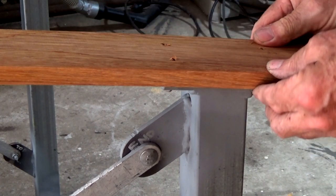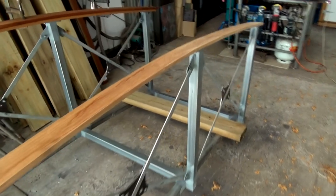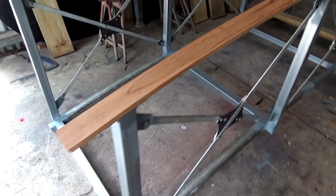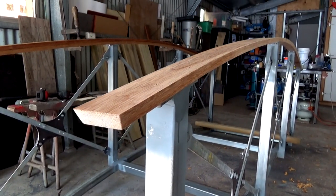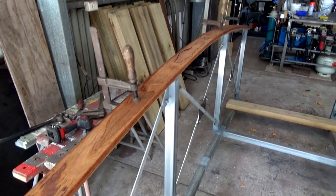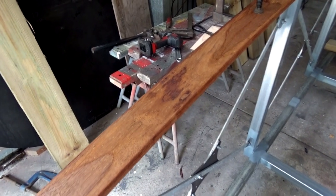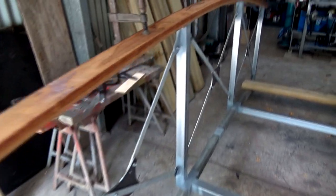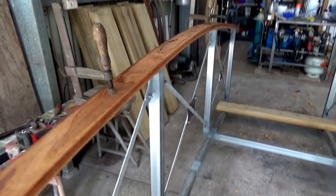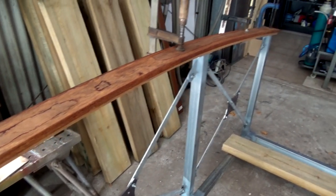That worked better than I thought it would, really. So I've got two more at the other end. There is the first piece of timber pulled down tight on the edge closest to the camera, with the ends cut to the correct 15-degree angle, and it's pulling down nice and tight all the way along. On the other side, I've got the upper layer of timber — the upper lamination — just left at the original width of 90mm with a pencil-round edge on all four edges. That's also pulling down nice and tight against the underneath section, which is going to be important when I bond this with the epoxy resin glue. We've got to get a tight fit all the way along — if there are any voids or air pockets, the glue won't bond and moisture is going to migrate underneath that cap.